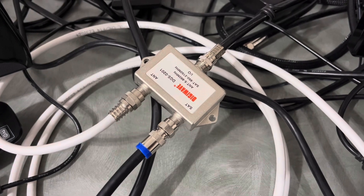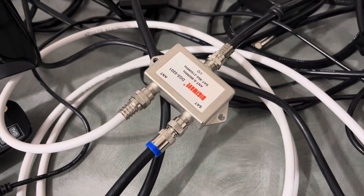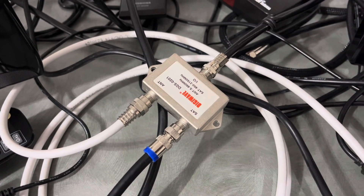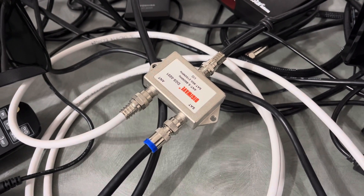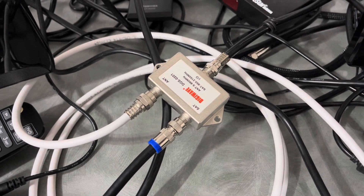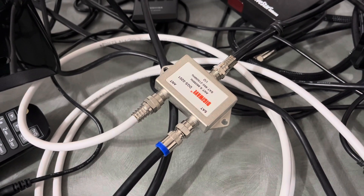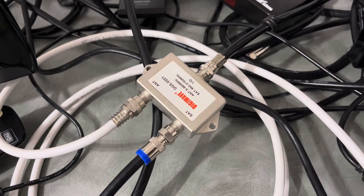This satellite and TV antenna combiner system works well for the purpose it's intended for. Usually I recommend running separate coax cables for TV antennas and satellite dishes, but if you're in a situation where you only have a single coax running into a building and can't run a separate one, then this combiner system is a viable solution. If you think these combiners will work for you, look in the description for a purchase link.